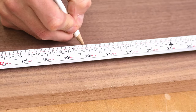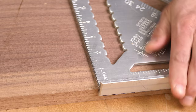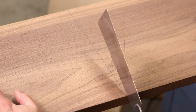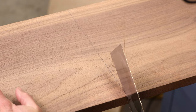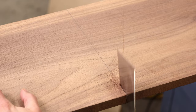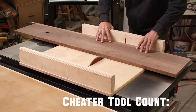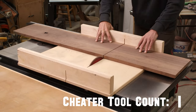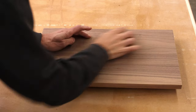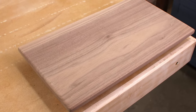The board is about 10 inches wide so I'm going to mark and cut it at 20 inches. That will give us roughly a 2-to-1 ratio, which I think is a nice ratio for a charcuterie board. With your line marked you can just use a fine tooth saw and cut along that. I like these Japanese hand saws — they leave a nice finish. For sanding, I like to start at 80 grit and if your boards are S4S that should be enough to get rid of the mill marks, then just work up to 220 from there.